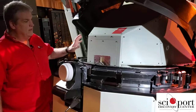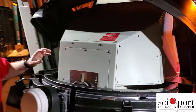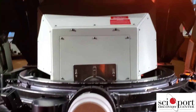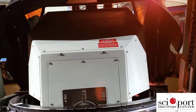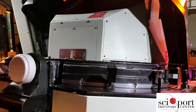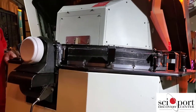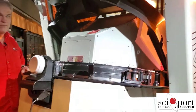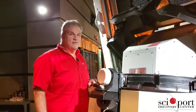The lamp in the projector is a 15,000-watt Xenon Arc lamp. It's water-cooled, and so are the mirrors in the projector — we're running distilled water into the projector, and that's how we cool things down. What happens if you don't have cool water going through? It shuts itself off.